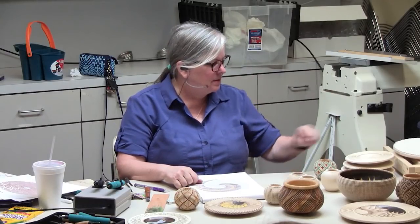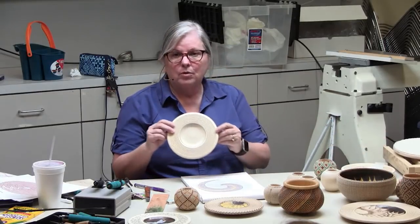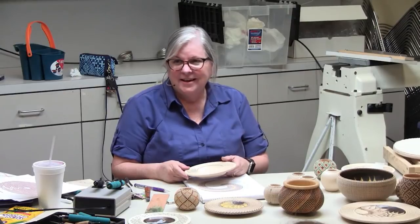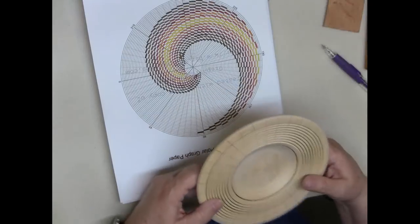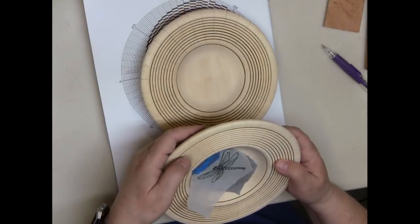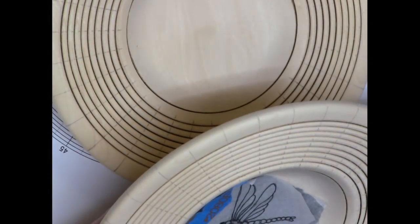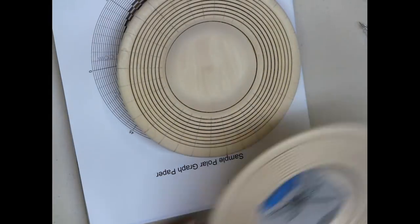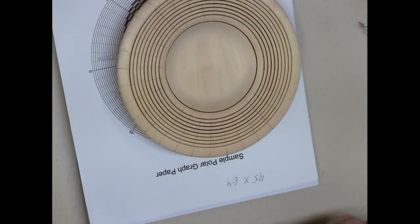This is a multiple of eight, and when I was doing these plates right here I was only using a quarter of the ones on my wheel. Let's count — two, four, six, eight, ten, twelve, fourteen, sixteen — so there's 16, and 32 divided by four. On the big one there's quite a few; I'd say probably over 200 lines on either side.